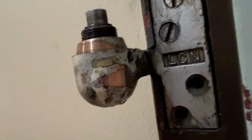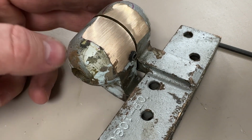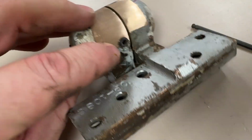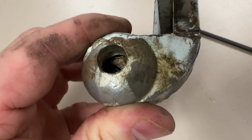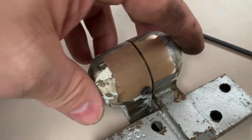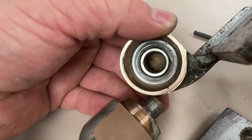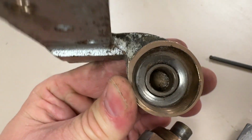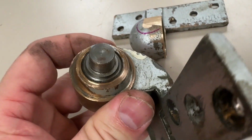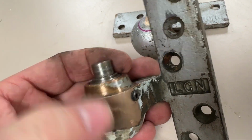Once this set screw here, this one is out of the way. And let's have one more look at this in good daylight, and then I'll explain what that is. So the little Allen key goes there, the big screwdriver goes here, and the two halves work together really smoothly, because the upper half also has a bearing when everything is cleaned up, and is replaceable and can be lubricated. And like I said, if you spin the screwdriver, this raises the height of the door.